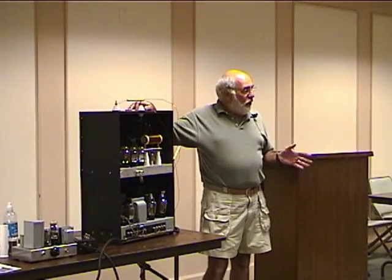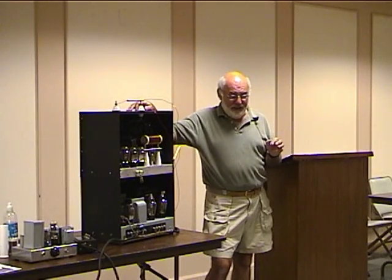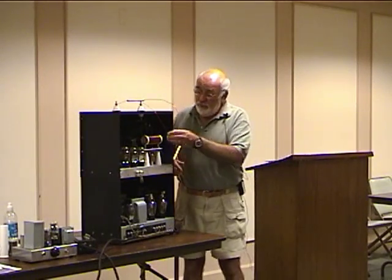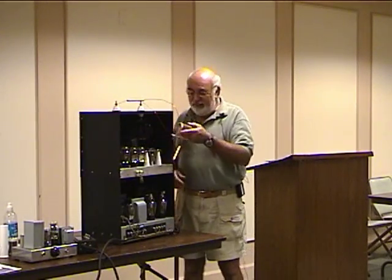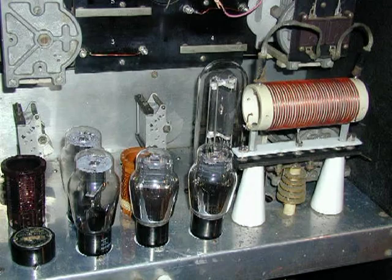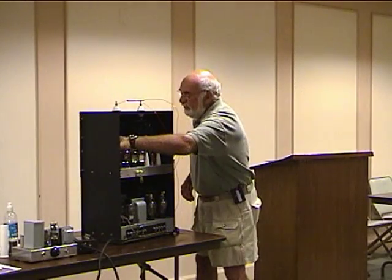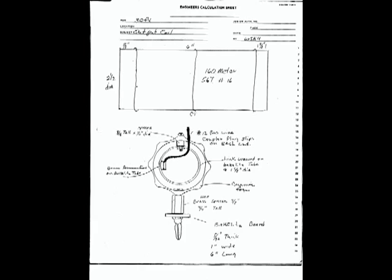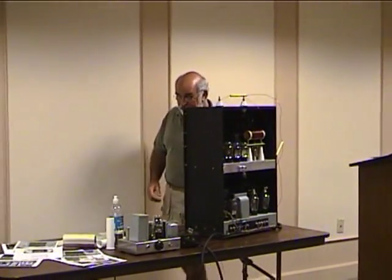The fact that it had no coils on it was presenting a problem. I had a photograph of what the coils look like but no coil form. So for the tank circuit, I robbed a coil form out of an old transmitter that I had and just kind of guessed how many turns to put on it for 80 meters. W5EU sent me a schematic of a 160 meter coil, so I had something to start with. This is an 80 meter coil wound on a coil form I picked up at the flea market.